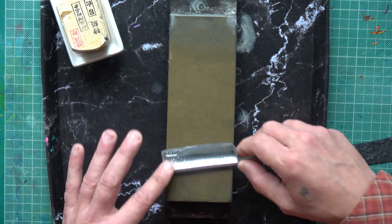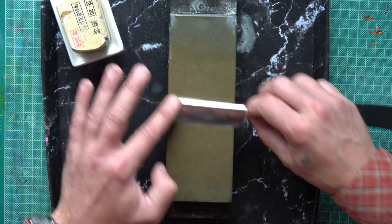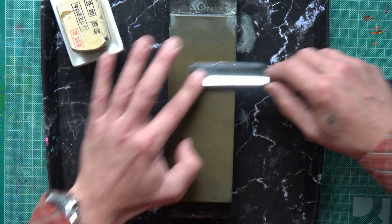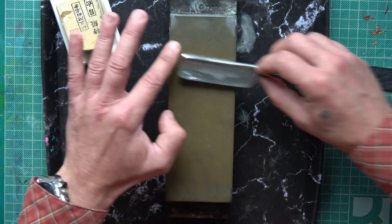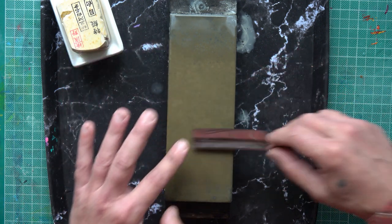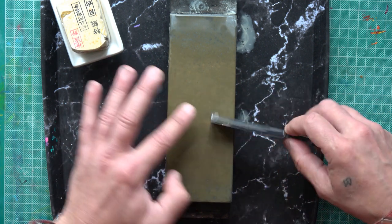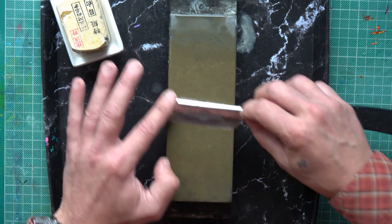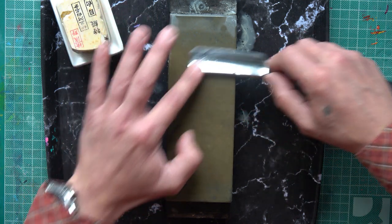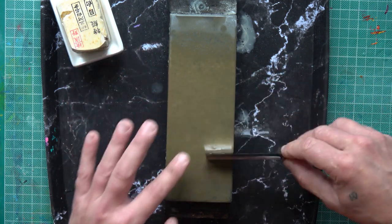If I hone 30 razors going from 8 to slurry to no slurry, and out of 30 of those razors I'm getting 4-5 that to me just are not performing the way I kind of know they should be, well, it means I've got to then put them back on the stones or do more stropping. So again, it's like this multifaceted thing.